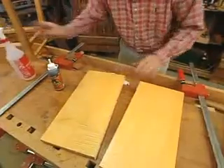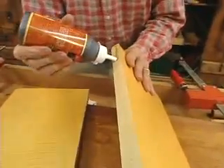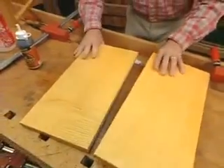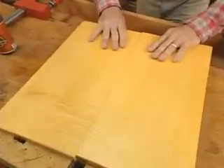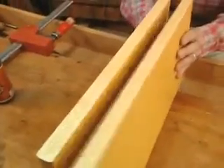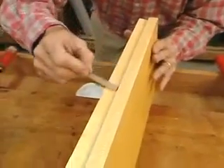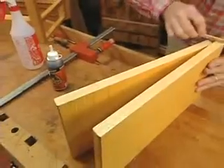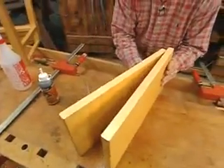You could use a rag with water on it as well. I lay a bead of Gorilla Glue along one edge, just like that. You don't want to apply glue to both edges — that'd be too much. Now press it together, rub it back and forth, and then lift it up. That has spread that glue beautifully. Now I like to take a piece of scrap wood and level that glue out. You want glue over the entire wood edge like that.